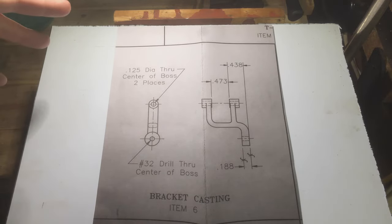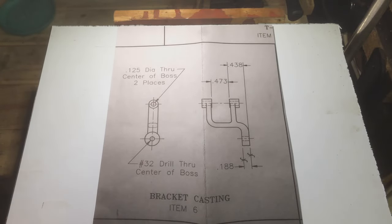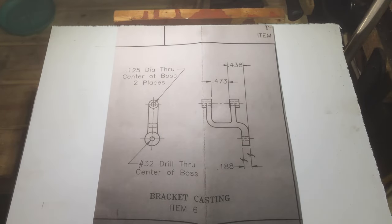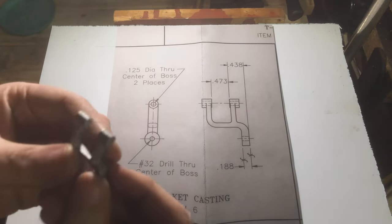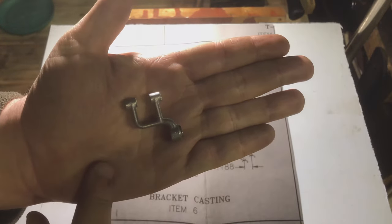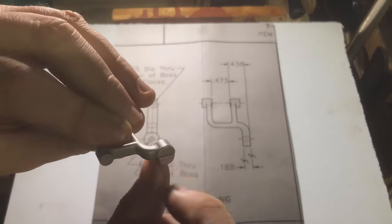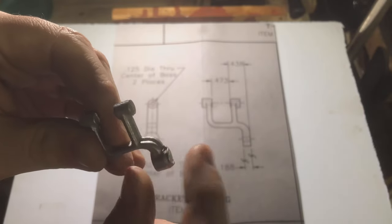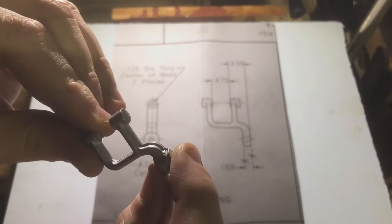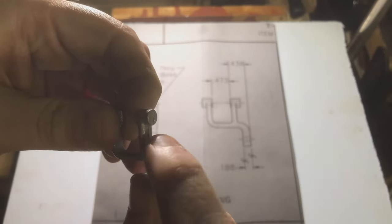This in the main plans is to scale, but I've blown it up so I can read it better, and it's just on a piece of scrap paper so I can make drawings and notes on it if I need to. This is what I need to machine. As you can see, there's quite a bit of flash left on this, and there's a significant step issue here — it looks like the casting paths weren't aligned properly. There's quite a significant ridge there.